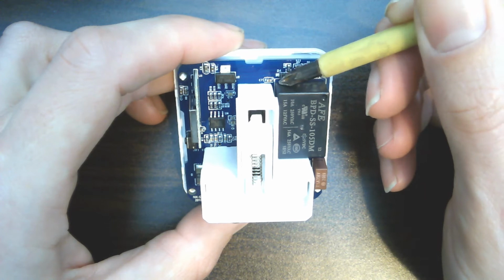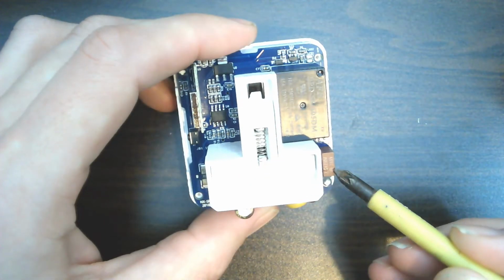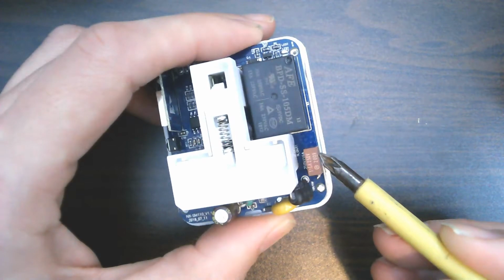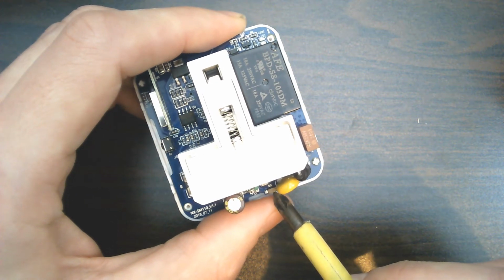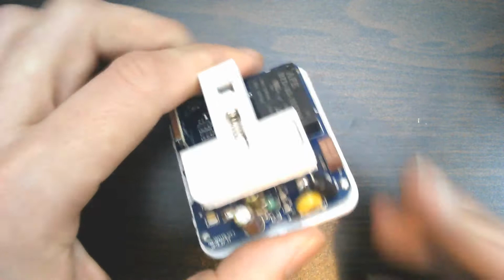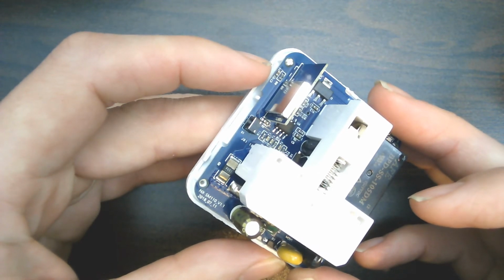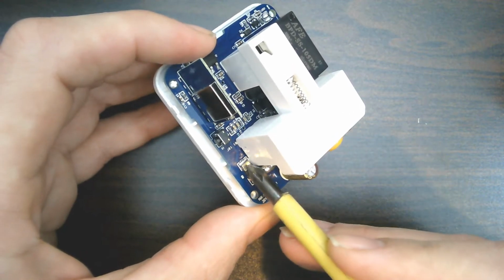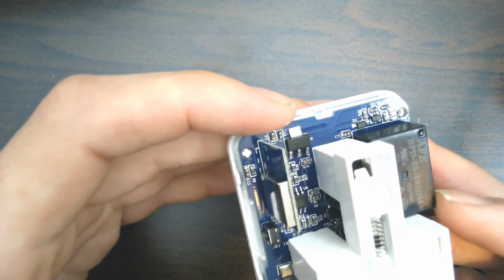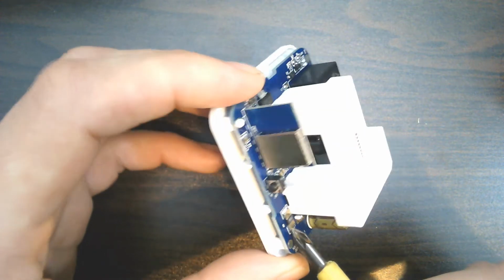You can see connections from the diode going down toward the relay. A couple of LEDs. Over this side we've got a 16 amp fuse, 10 ohm 1 watt resistor, a MOV, diode, a couple of resistors there, big inductor, a couple of small but high voltage capacitors, 400 volts, big resistor here, 0.001 ohms, so that's the input current measuring shunt.